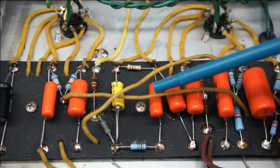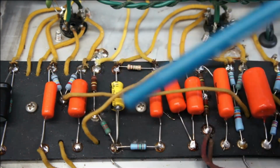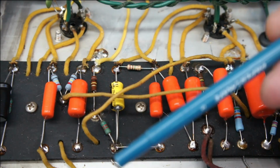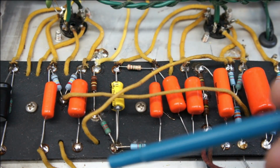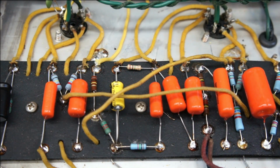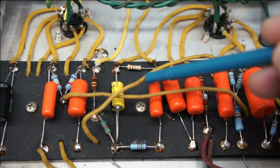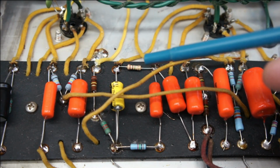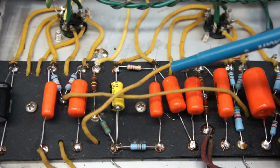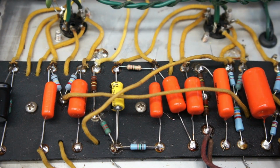So I rebuilt the tremolo section and got the preamp circuit back to stock with the correct tone controls. The person who had done the mods had done a nice job in the sense that he had moved around the various pots to get what he wanted, but he had not thrown them out. Likewise, wires like this were not cut. They were rearranged to the connections he wanted, but were folded up in such a way that you could put the amp back to stock. So whoever did the mod actually did a decent job.